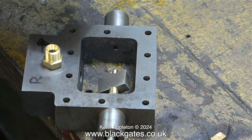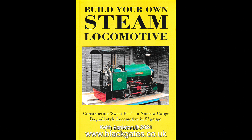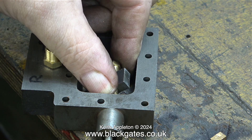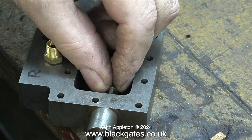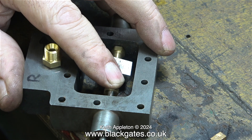I find that the construction of this mechanism is not good. If you're building one of these locomotives, you really need to buy this book — it does make the job a whole lot easier, particularly for beginners. I would just like to say that in the book, the slide valve driving mechanism is constructed in exactly the same way as you see it in this episode. But I'm going to modify this arrangement. When I make the new drive blocks from gunmetal, I'm going to thread them down the middle so the valve spindle will screw directly into the block. This method is very poor and, in my opinion, just too fussy and wrong.